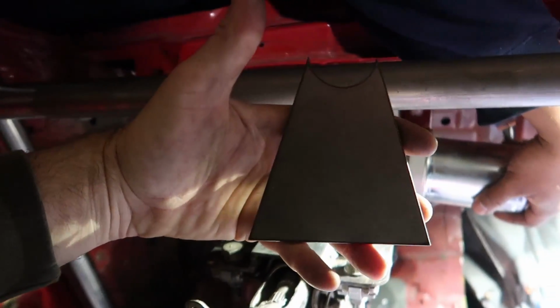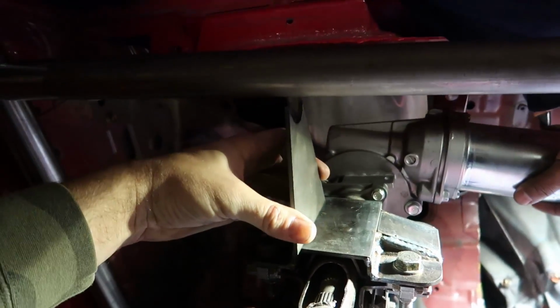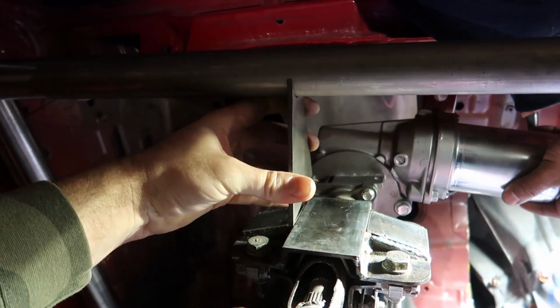And what he did was he made up another quick little bracket. We're gonna have two of these, and essentially these are gonna hang off of the crossbar. This is really just a quick and effective way to do this. It's super durable. It's made out of really thick plate. And then we'll also toss in a 2-hole gusset plate between these guys to shore it up even more.